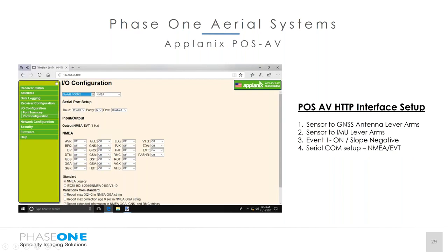For the Applanix AVX 210 overview screen, this allows you to configure the AVX 210 — you can configure the mounting angles, lever arm values, and create your communication commands. It also controls the logging, which is done to an internal logging card of up to eight gigabytes, providing many hours of potential survey data.